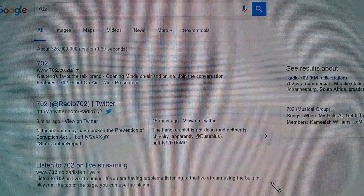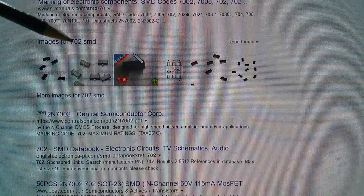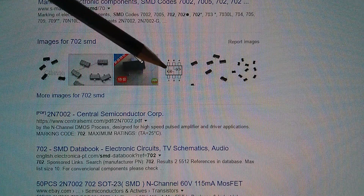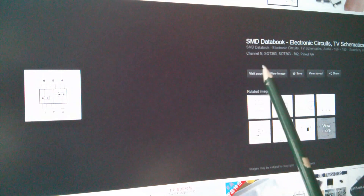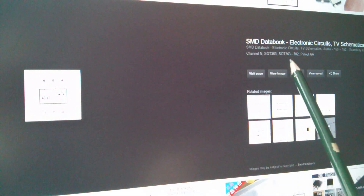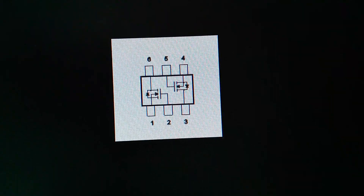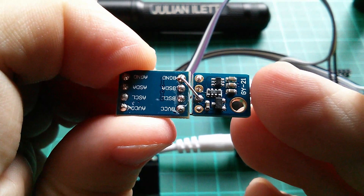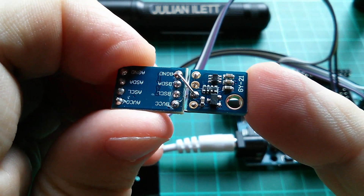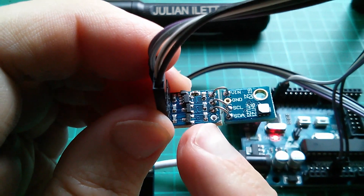As for the 702 marking, just typing '702' won't work, so let's try '702 SMD'. We're getting a lot of results for the 2N7002, and there's actually a six-pin device. This says N-channel SOT363 — so maybe that package is a SOT363. You can see these are two N-channel MOSFETs in a small six-pin package. So the 702-marked chip is a dual MOSFET — basically the same components as on the level shifter board, making the level shifter completely unnecessary.